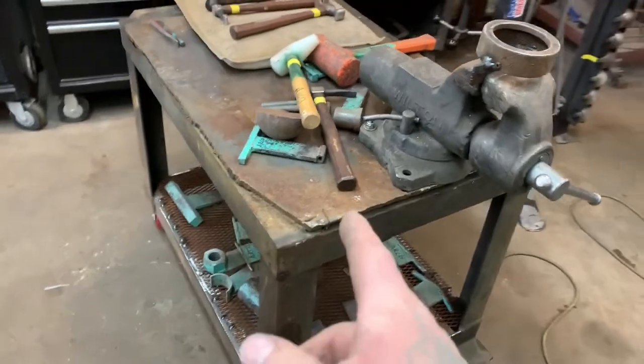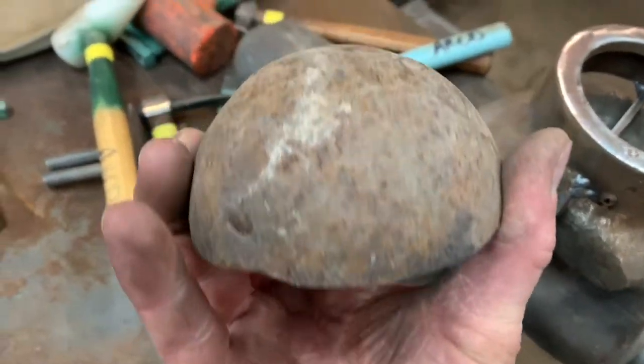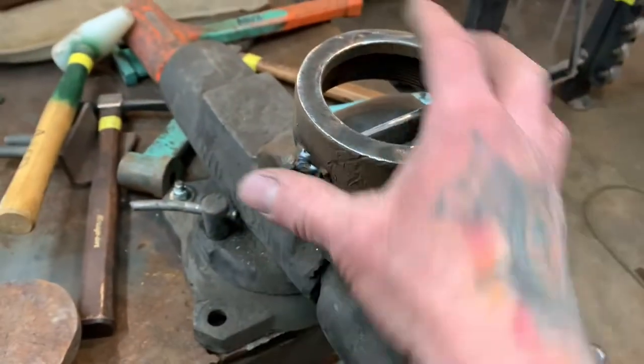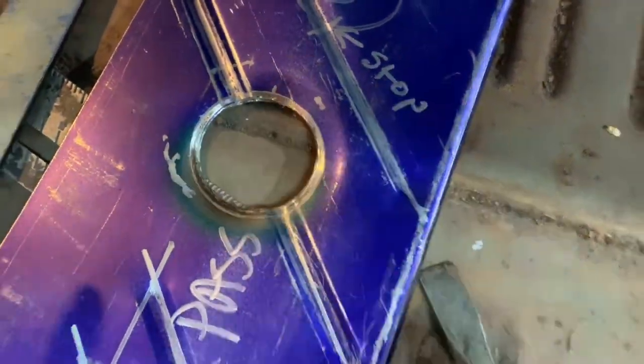It's fitting a lot better. This dolly stand that I made a couple days ago is working awesome — I put all my post dollies down here and put some expanded metal on it so you can set the post dollies on there. What I did today is I have a cannonball that's cut in half and I made this post dolly — just an old pipe flange, welded a piece of metal on it so you can drop it down into the vise to hold onto it. Then I drilled a hole in a piece of sheet metal, hammered this down with a dead blow hammer to make a dimple die.